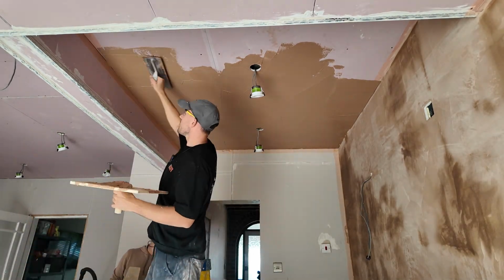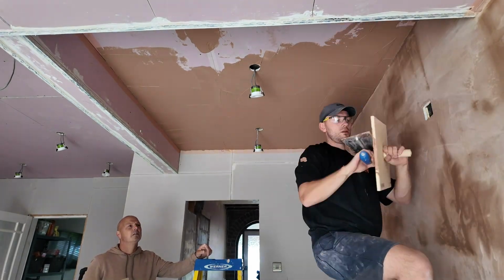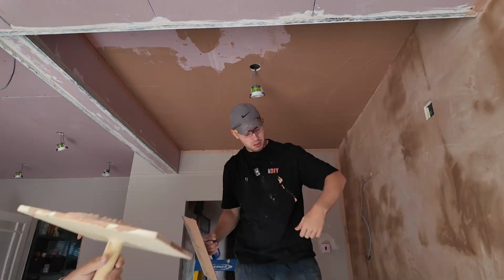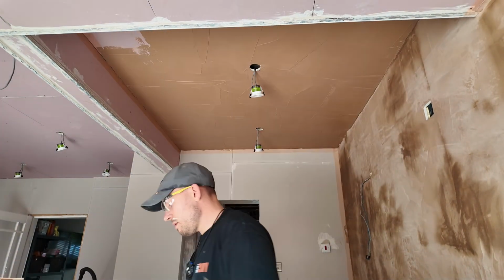One thing I wish I had done, which I've seen a lot of plasterers do since, is plaster over the joint lines first, covering that fibre tape. For me, it felt like it was those areas that would create the most issues.